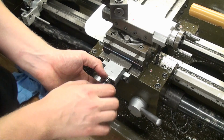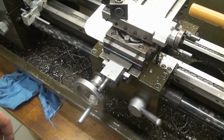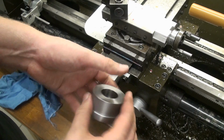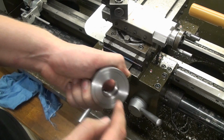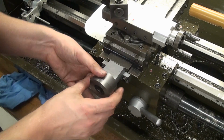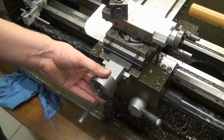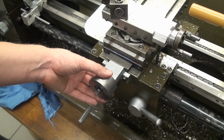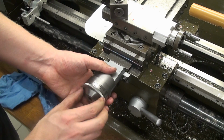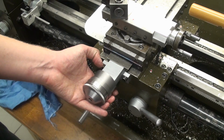And I really don't like the axle bearings for such a purpose. And this is our bearing block, our new one. We still have to drill the holes to mount it to this hub here, but it will go on like this, with one bearing in front and in back, angular contact bearings, and in front will sit the micrometer drum, and here will be a crank, a ball handle.